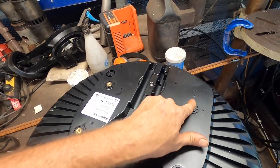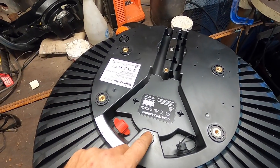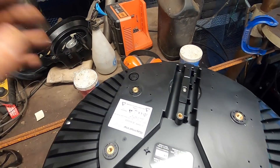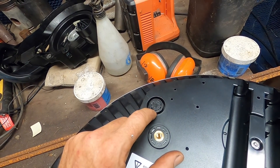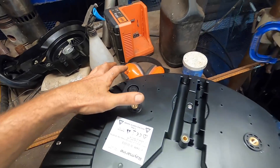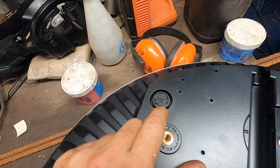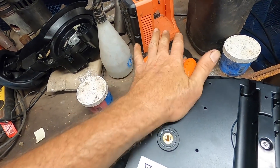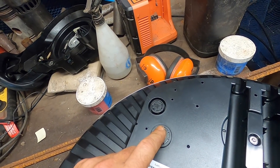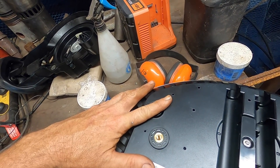We've got our four holes drilled now on the mounting plate. There's a threaded point here for a safety lanyard so it can be tethered to the mount if it's unbolted. This is actually a one-way port — moisture can drain out but not get in. So if humidity ends up inside the unit, this allows it to drain. There needs to be a hole on the plate to allow this to drain. Rule of thumb is enough space so you can fit your finger in underneath it.